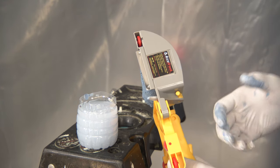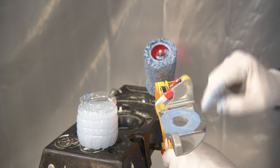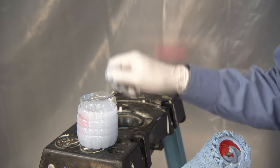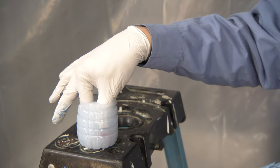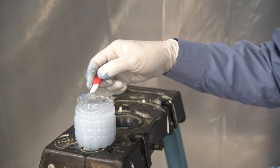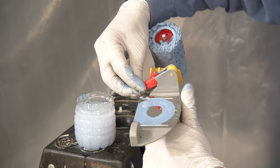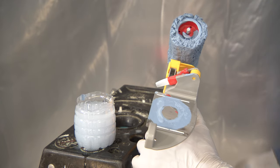Let's say we've edged a room and we're not going to paint for a little while, maybe five, ten, fifteen minutes. What I'll do is go ahead and take the brush out of its holder. This is just a water bottle that we cut the top off of, and we'll just drop it in there when we're not painting. That way we can keep the paint from drying out in the bristles. When we're ready to paint again, we'll go ahead and take it out, swish it around, take off any excess paint, and stick it back into the holder.